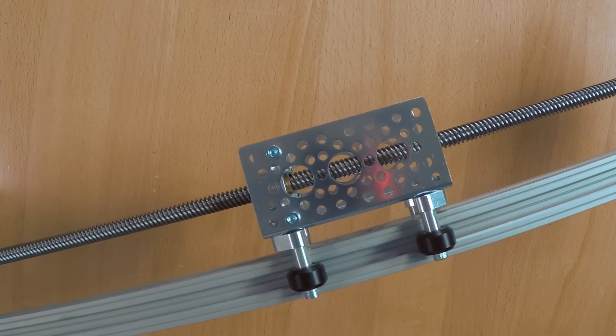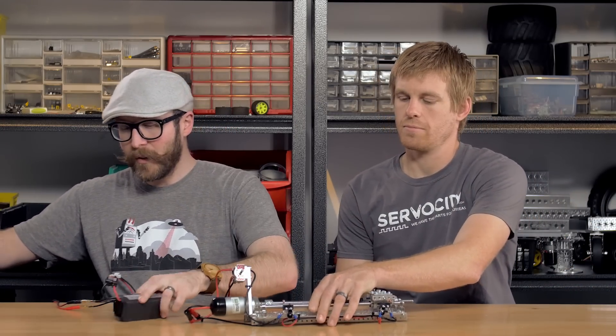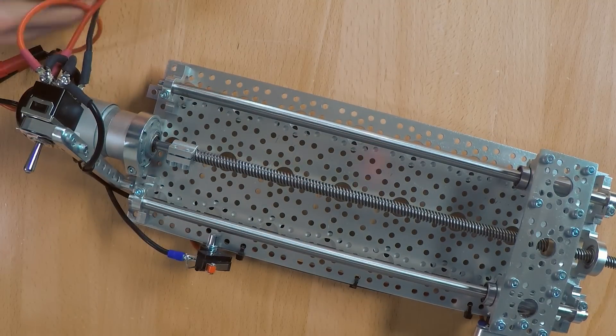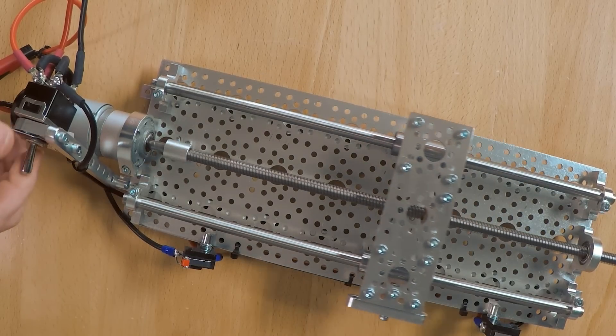Lead screws provide a great way to make your own linear actuators, which is one of my favorite things about them. Because it's Actobotics-based, you have a multitude of ways to build your linear actuator in a variety of lengths and support styles. In this particular example we're using X-Rail and V-Wheels, and in this next example we're using linear bearings and shafting. One of the advantages is a lot of holding power and thrust. It might not be as strong as one of our pre-built linear actuators, but it gives a lot of flexibility. You always need to tie the lead screw to the motor in some fashion — whether that's via gears or direct drive as we've done today.